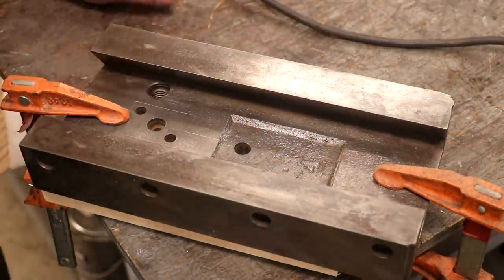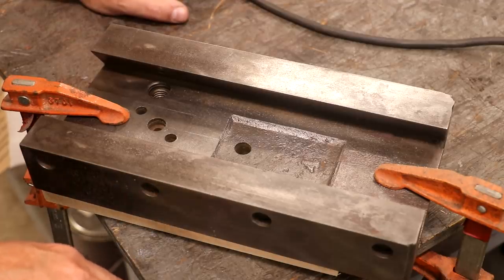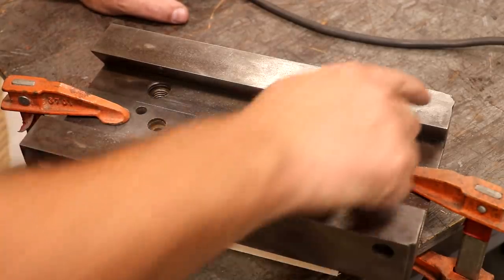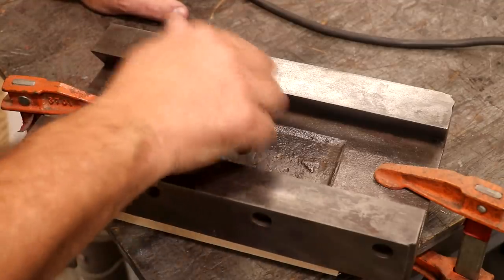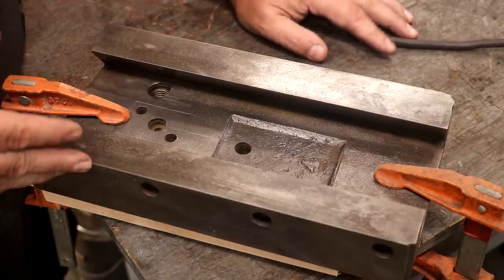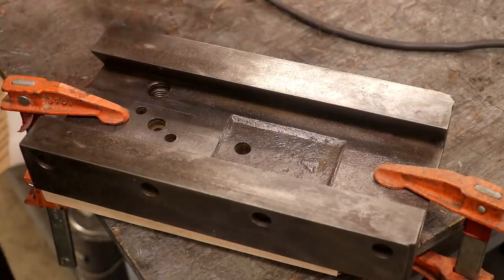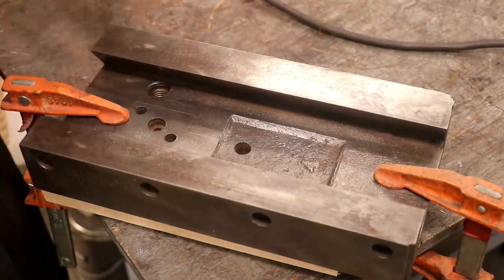I have not blued this up on the surface plate yet, so I really don't know what shape it's in. We'll do that after our first roughing pass, but I am encouraged because I can still see some of the original scraper marks. There are definitely areas more worn than others — the ends appear more worn than the centers, and there's a little area where some moisture got in, causing slight pitting, nothing major. I can still see the planer marks from where this was originally made. People have been asking whether it came scraped from the factory; in this case it looks like they just planed it and let it roll out the door. We're actually taking it a step further by scraping it. Since this is a worn surface, it will be best to scrape it and get everything trued back up.